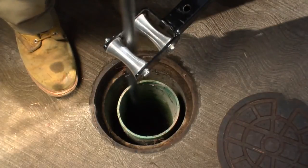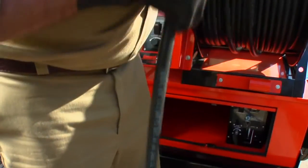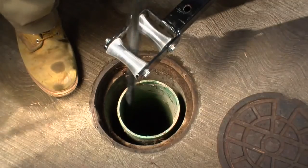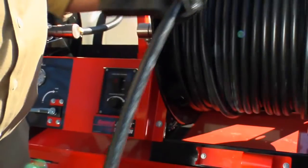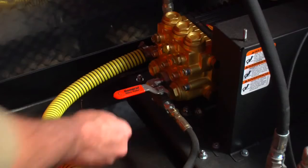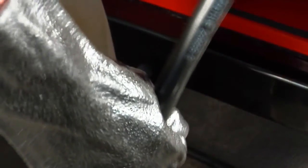Allow the hose to slide down the line a few feet at a time, then pull the hose back half the distance advanced. The actual cleaning takes place when the hose is pulled back toward the operator. To get around tight bends or help the hose slide more easily on longer runs, turn on the vibrapulse valve located next to the pump. The vibration helps overcome the friction between the hose and the walls of the pipe.